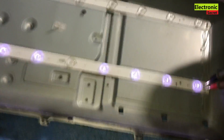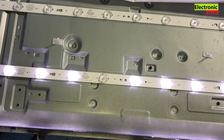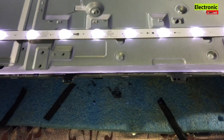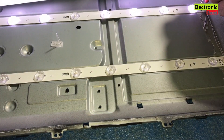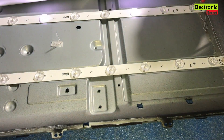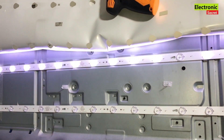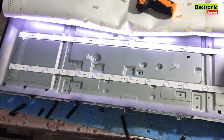Now I will show how many lights are glowing and how many are faulty. This first strip has 15 lights — the center light is blinking and not glowing properly, so it is bad. Checking the second one: there is also one light not glowing, and the second-last is also not good. The light on the fifth point is not working, so this strip is also bad.